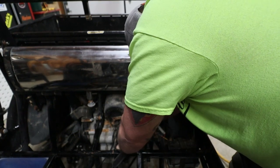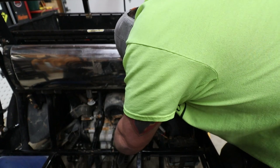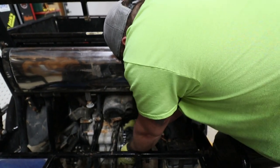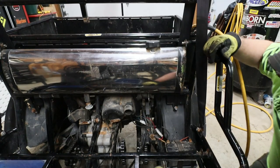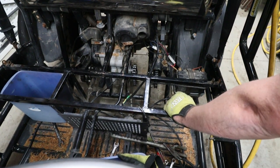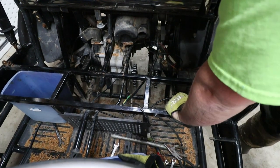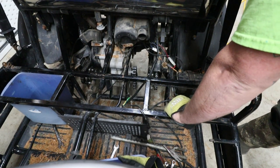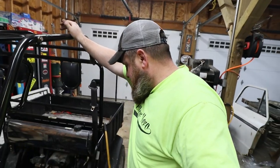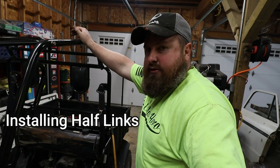I am one tooth off — I can't even get the gear or tooth ratio right on this thing. I'm either going to be a link too short or a link too long. If I put it in there she's going to fold in on herself and pop off. I'm going to have to change up the size of chain or figure out how to put an idler shaft in there — like a jack shaft. That's it for tonight, I can't figure this one out.